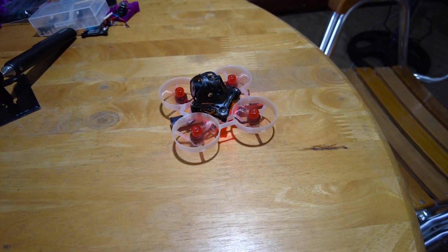Today it's going to be just a quick video. JP sent me his Mola 6 HD and two of its motors aren't working properly. They are spinning, however they're stopping intermittently and this thing can't even lift itself up into the air. If there's a problem with the motors or ESCs, that would make sense because the two working motors or ESCs would balance itself out to keep this thing stable. If two of them aren't producing enough thrust, then the other two properly working motors would lower their thrust as well to keep the balance. The two broken motors or ESCs are going to be the limiting factor for the overall thrust, which is why it cannot fly.